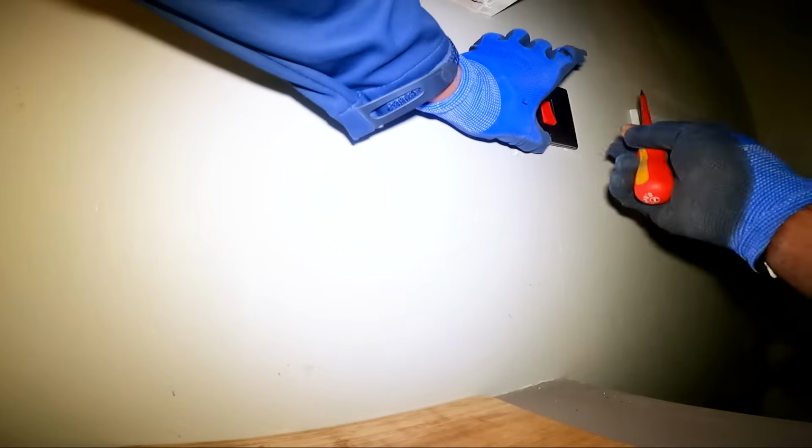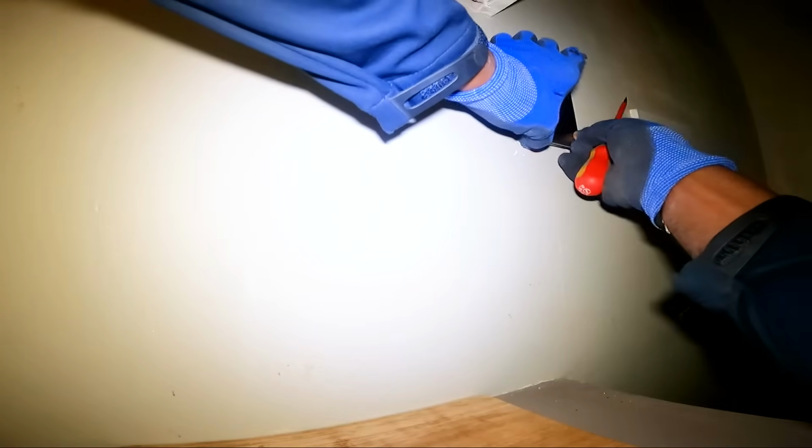Right, this, when it's switched off, the neon stays on. Switched on and off. I think it's because they've put the incoming, the load where the mains should be and the mains where the load should be. I think that's the problem there.